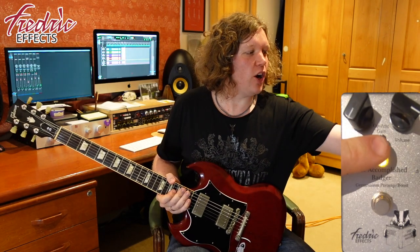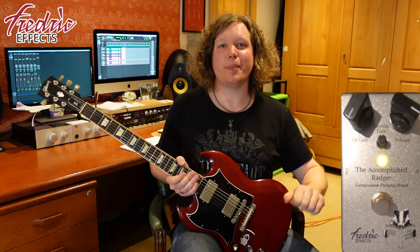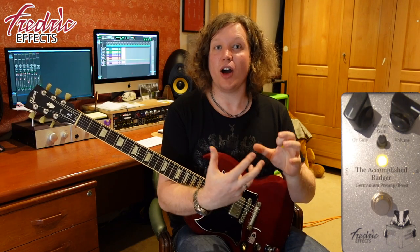So just a touch more clarity overall, a little bit of warmth and fatness in the low end, that's probably the new output transformer working its magic, and overall it seems to be shelving off a touch of low end, which into a Marshall JTM45 is no bad thing at all. So let's stick with the op amp gain then. I'm now going to turn that up and let the actual op amp overload itself and distort to show you that lovely gritty breakup I was telling you about earlier.